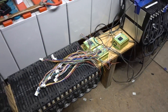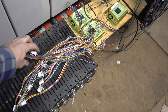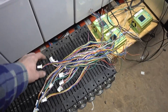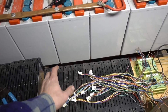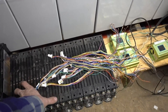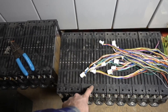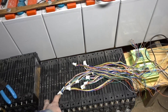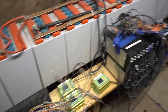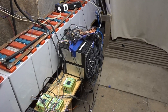I'm going to get back to it. What I'm doing is hooking six of these connectors up in parallel and then the other six in parallel, and then the six of one set and the six of the other set are going to be in series together. So there's going to be six parallel packs and then those will be in series to get me the same setup I've got there. Hope you guys enjoy the video.